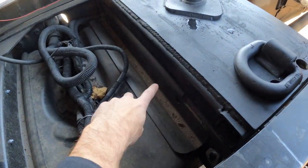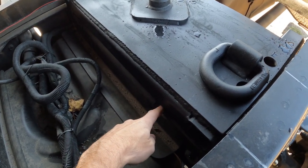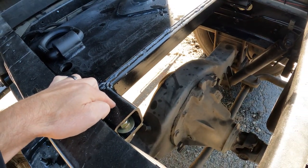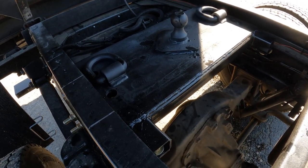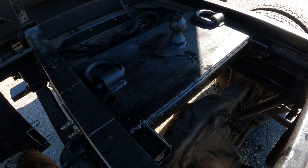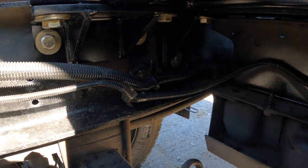So you can see the cross member back here, just on this truck, this is how it's worked out. The cross member back here right before the rear fuel tank, the tubing that we use is resting on that cross member. The material we used was 1/4 inch 2x2 square tubing, and on the back where it rests on that cross member, we actually used a mill and a hole saw and cut holes in it where it would kind of cap over those, I guess they're carriage bolts or rivets or something that goes across that cross member so it wouldn't set up on top of those.